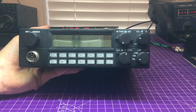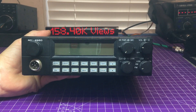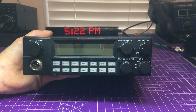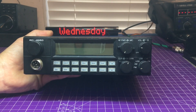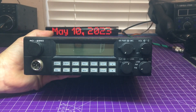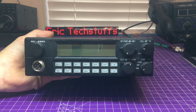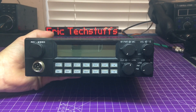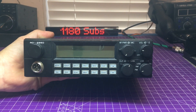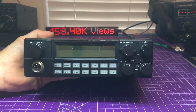This radio does have a split repeater option available, and that's great on 10 meter FM repeaters. Yeah, it's not as prevalent as 2 meter or 440 repeaters, but it's still a fun option. A lot of 10 meter repeaters were still open and not using CTCSS tones to close them down a bit. I remember even into the late 90s there was a repeater in my area that would get kerchunked all the time just from DX and static.